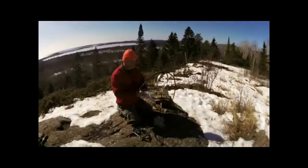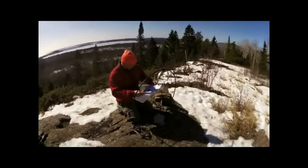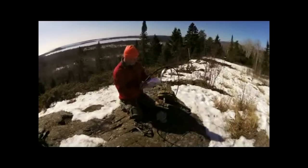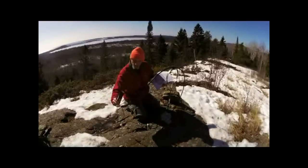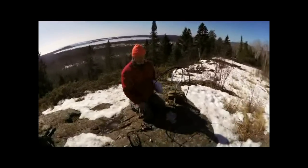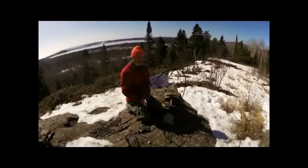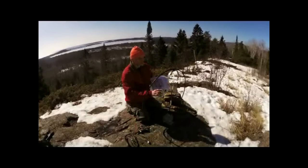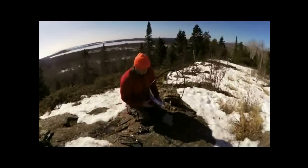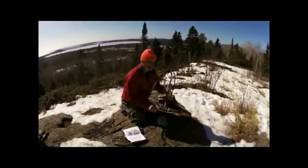So we've got it assembled. There are a couple of different sections of coax. Because we're using the small coil rather than the large one, we're going to use the short piece of regular coax to the back connector. I'm all ready to go with the loop — all I need to do is bring out a radio and adjust the tuning for best receive. If I was using the big loop at home, I would use the coax with the ferrite cores on it. Next step is just to hook up the radio and coax.